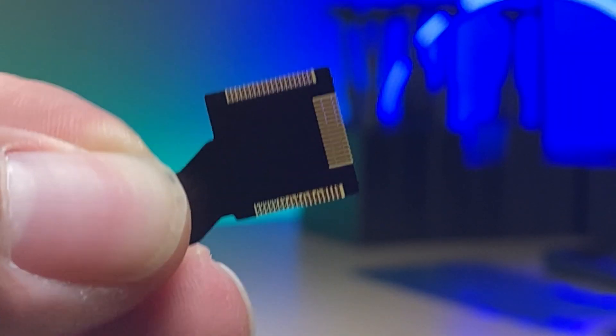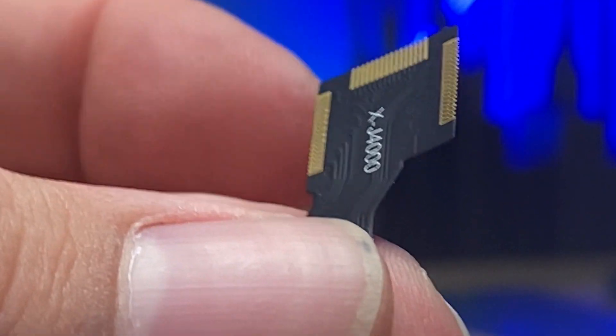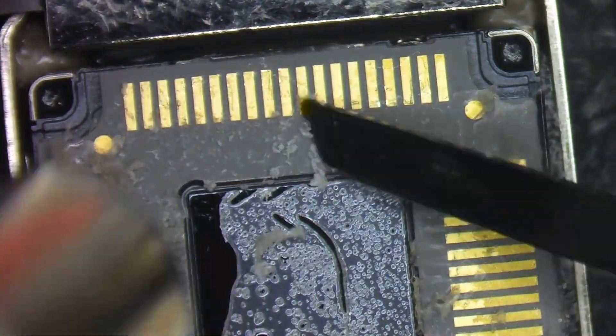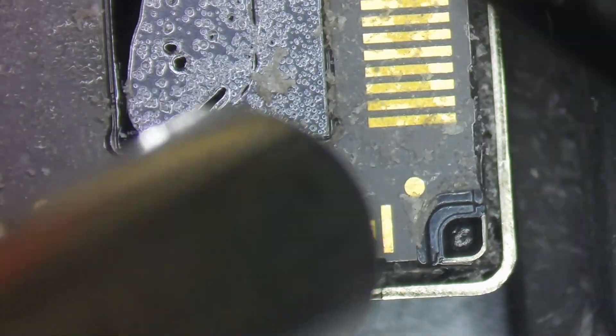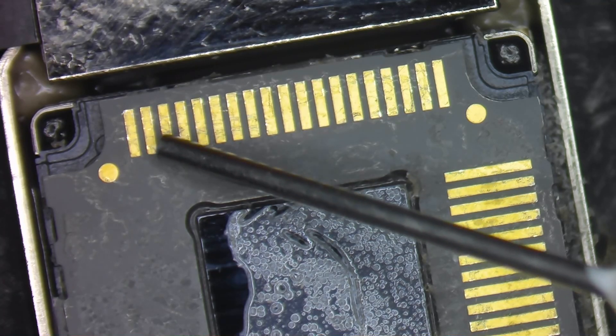This is the flex that we'll be using, designed specifically for this repair. I'm going to carefully take some hot air at around 200 degrees and, using my scraping tool, get at it. Once I clear all of the adhesive, I will have a nice surface to solder to. I'm going to add some solder paste here.